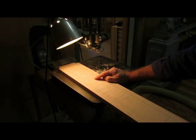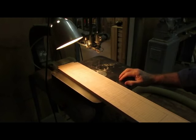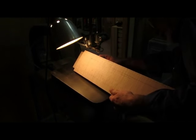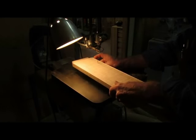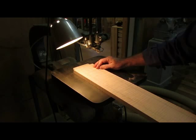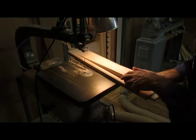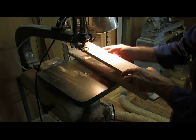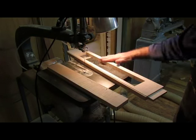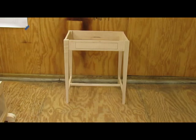The more important part will be to keep it square along the edges because that's harder to clean up on the inside of the opening. All that needs to be done is to thread the blade through the pilot hole, bring the saw blade down, and saw away. There's the cutout and it's fairly good — the opening is pretty square. The corners of course have to be pared off, but a little planing and I think it'll be just fine.